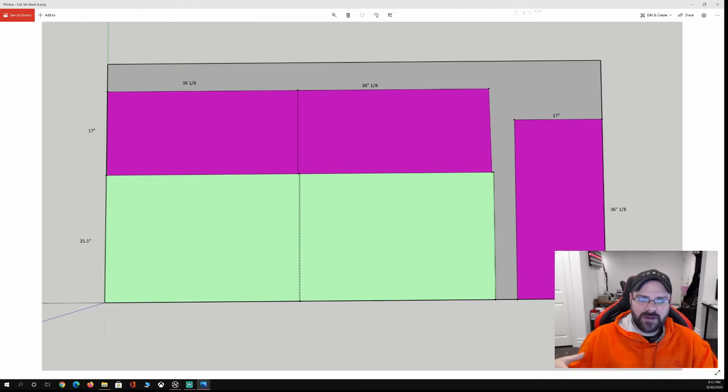And these are all 4 feet by 8 foot pieces of finished plywood, whether it be finished poplar 3/4 inch or finished birch 3/4 inch. I didn't use finished birch, but I recommend it for the tabletops because they delaminate a little bit less. You can still get delaminating, so you've got to check them. And then the half inch for the backer board.